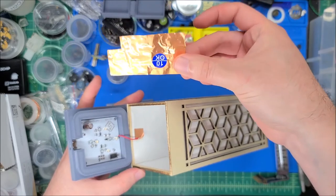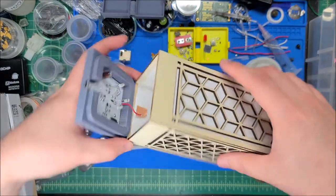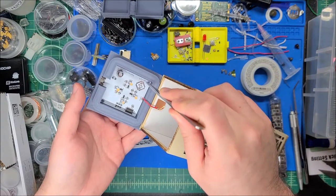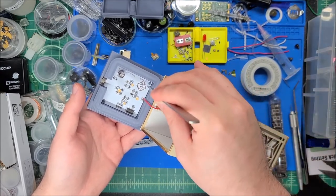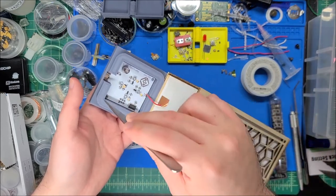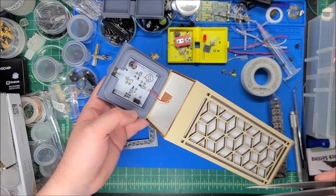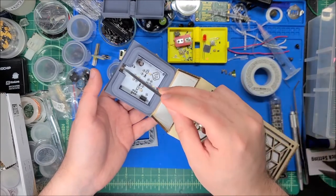The PCB snaps into printed posts, but the tolerances on those were a little tight so I had to press-fit it with a flat piece of metal and a hammer — this PCB is not coming out easily. In the models I'll be uploading I've already decreased the diameter of those posts so you get a snug fit without needing to hammer uncomfortably. The circuit is actually really simple: USB port in the back, nearly flush with the front; a connector in case you want a battery; and an electrolytic decoupling cap on the 5V rail.